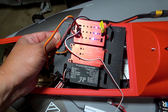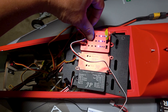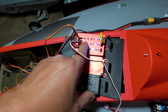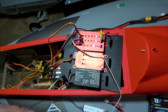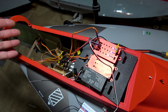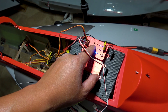As far as your buttons and modes — the mode selectors for each independent retract — you're going to press and hold that button. You have about three seconds in the menu to change any kind of mode. With the first mode you'll see letter B flashing. Options for this one are basically just to reverse the direction of the servo — you can go either A or B. You want to make sure the gear door remains open when the landing gear is down, so you're verifying that the retract door servo is not operating in reverse.